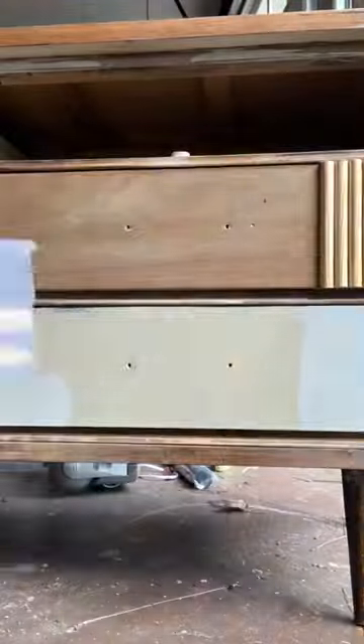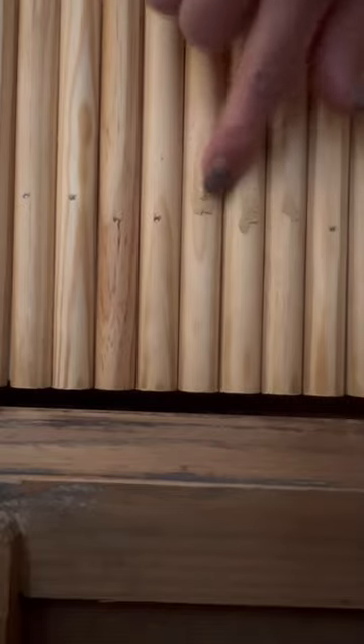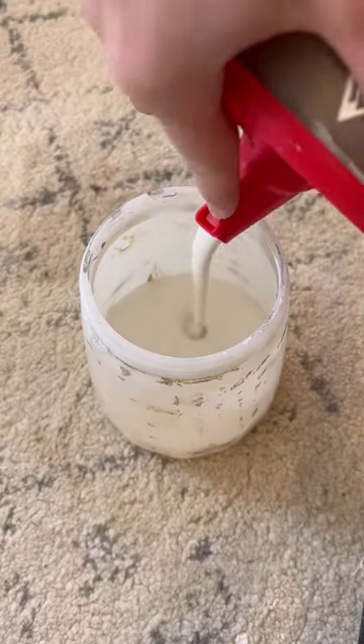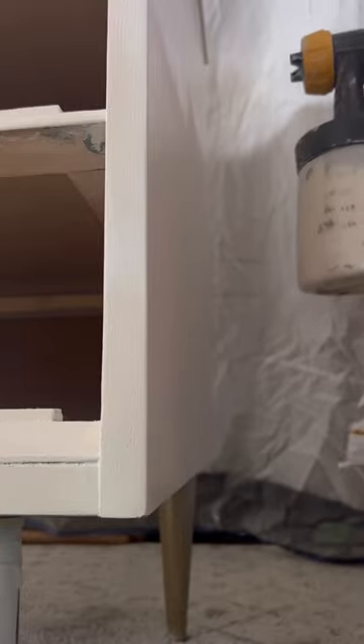Next, I attach them with a nail gun, and now I'm using wood filler and caulking — a lot. Then I primed everything and I'm spraying it with my favorite paint: Benjamin Moore Advanced in the color Fossil.